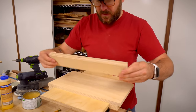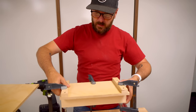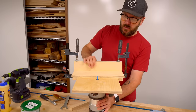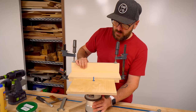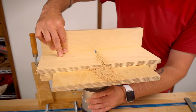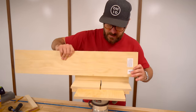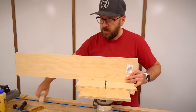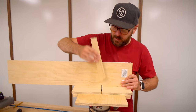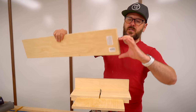I got the first part of my fence cut and we're just going to glue it on right there. Get that fence clamped on there, and I'm also going to run a couple of screws in from the bottom. We need to be able to run through the bit, so I'm just going to slowly run the bit through for this front fence. I want it a little taller than this — something a little bit taller will give us more clamping room and stability for our pieces that we run through. So I'm going to cross cut it to width and then rip it to about that size.